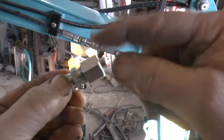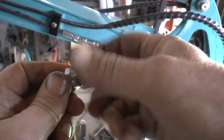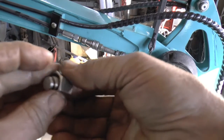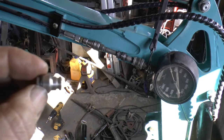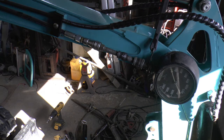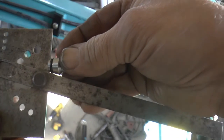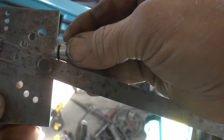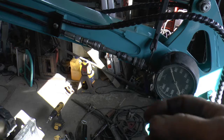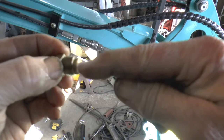Here's the regular cap that was on there, and that's the end we need to recreate. So I took this cap off and took that little plastic snap ring off there. Now I've got a sample of what this seals into. I took a protractor kind of a thingy and figured out that it was 12 degrees. So I took this, put it in the lathe, and turned it down to 12 degrees — it takes cutting all of that tapered part away.